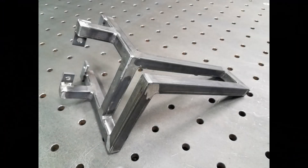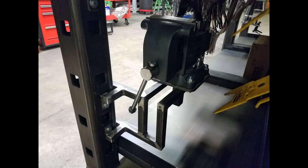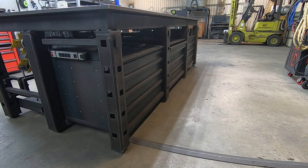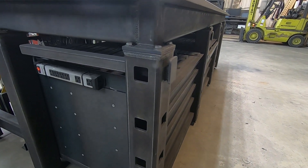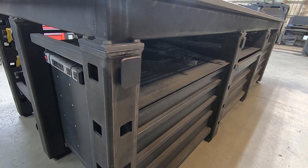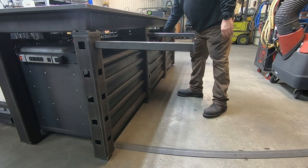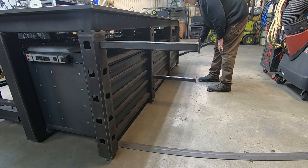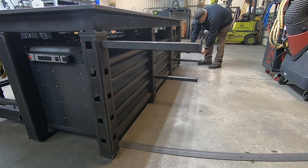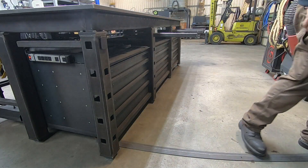Here are some pictures of this storage rack that's out of 1x1 square tubing and how it is mounted to the outside post. Here we're looking at one of the corner legs that are 4x4 quarter inch tubing — they've been cut on my plasma table. I cut these square holes to receive a 1.5 by 1.5 inch 3/16 square tubing bench dog, as I call them. They pull out to support weight and I can put them in at different heights, which comes in handy if I want to have a frame or something held in place on the side of my table at different working heights.